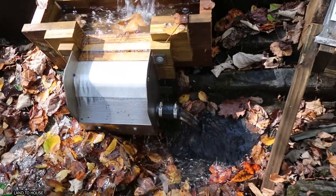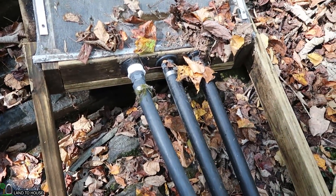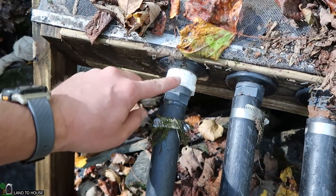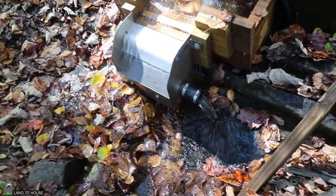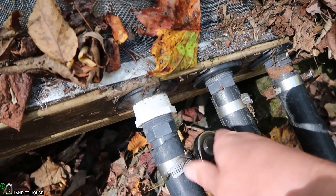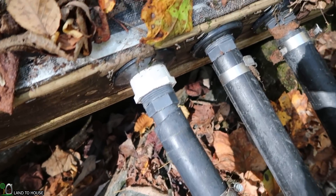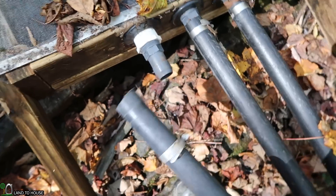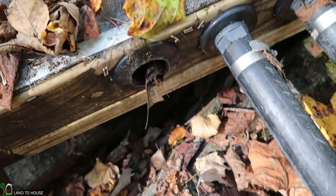So here's what we're going to do now: hopefully we're going to attach this pipe to the 2-inch outlet, and then attach two of our — it looks like that one's got to step up anyway. If we can get these out, we'll be able to get those onto our new manifold. Actually I think we can use this one because it looks like it's an inch-and-a-quarter right there. I brought a couple of tools — hopefully that's all we need. Get that hose clamp down there so maybe this will come sliding off. And I can use these channel locks here to get that off. I'll probably pull those bulkheads off because those are still good.